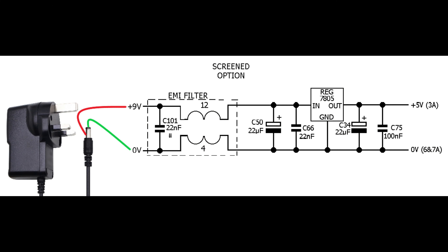Let's have a quick look at the schematic. The plus 9V here comes from the outer edge of the barrel from our DC power supply, and the 0V is connected to the inside of the barrel connector. 9V goes onto the input of our 7805 voltage regulator, which should produce a steady 5V DC output. Voltage regulators do tend to fail, so let's consider hypothetically how this thing could fail. The input could be shorted to the output — I don't think I've seen that happen, but that would result in a significant current draw, more than 0.02 amps, as we would have 9V going off to the rest of the power circuit.